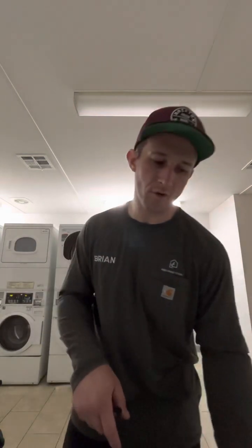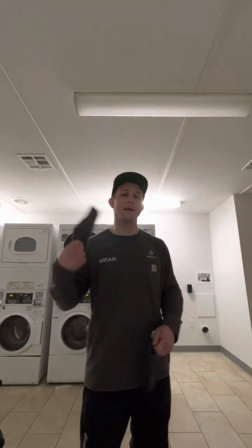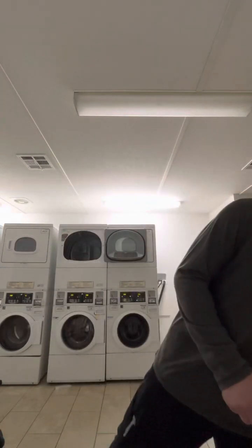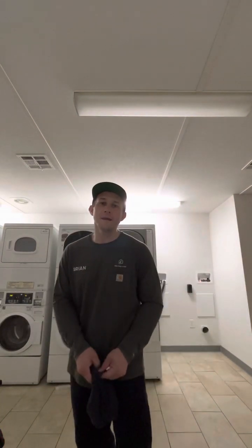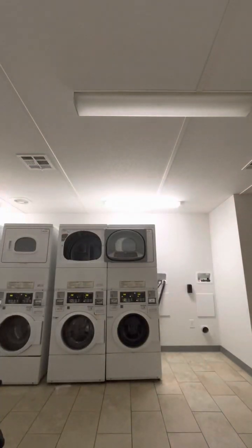You need to get that info from every single thing that you're plugging into the wall. You have to have that info. Get all of the wattage. And if there is no wattage, then there's going to be amperage. There has to be one or the other. So get all of that electric info for every single thing that you're going to need to make your food and run your food truck. And make a list of it and write it all down. Think of, if you were to expand down the road, what you might add, because bringing us into our next tip,